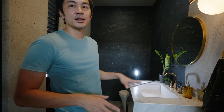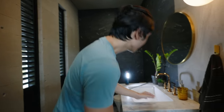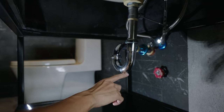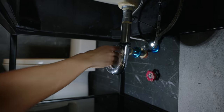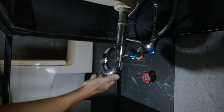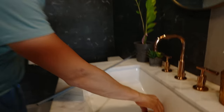As promised, we are now in the sink area of the bathroom. This is a different problem because here in the sink, most likely it's hairs that get caught. This one isn't clogged, but I'll show you how to go about it — it's fairly similar, just a little bit of a different step. If you come down, you'll notice it's the same P-trap, so this is what you remove first — just remove it from here at these knobs. But to remove the top portion, that part is a little bit different.